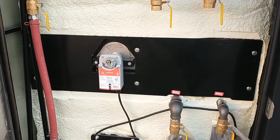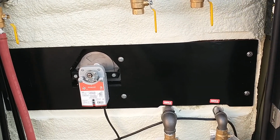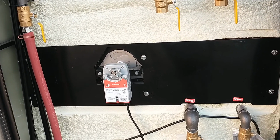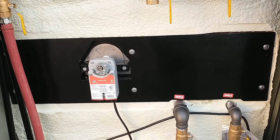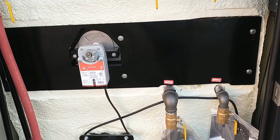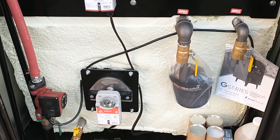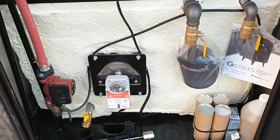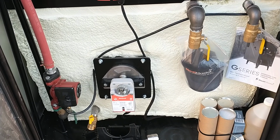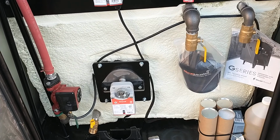That center damper there feeds air to the firebox. Again, that panel comes off, and on the right hand and left there's a straight shot right into the firebox, so it's easy to access. I would think that'd be probably once a year, so I take that off and check the channel. So far I've seen very little creosote in those airways, but it is easy to access. The bottom damper does the air channel, feeds air into the reburn, and that would open and close based off what the O2 sensor is telling it to do. So it gives a pretty accurate fuel air mixture.